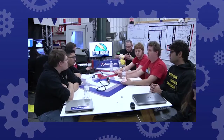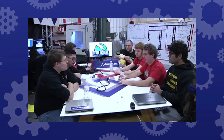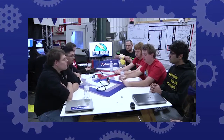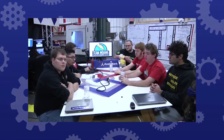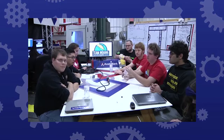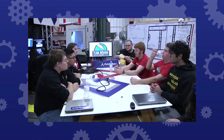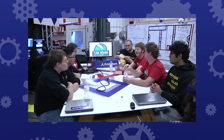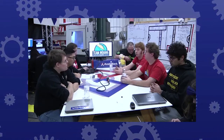Something to clarify: at this point we're going to stick with the six-wheel pneumatic drive for our prototype and finished robot — not because the Rhino Drive doesn't work, it's absolutely functional and works very well. But the nice thing about the pneumatic wheels is it's a cheap, easy-to-get option. The 1FU frame gives us very good places to mount our systems: our shooter, double-jointed arm, intake, electronics, and bumpers. Using that framework is a really nice foundation starting point for the whole robot system.